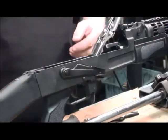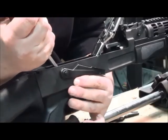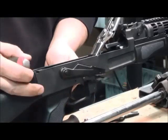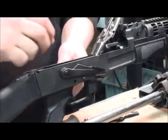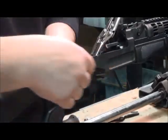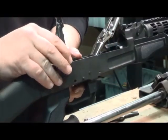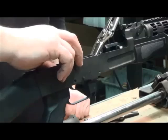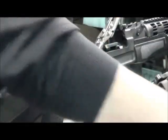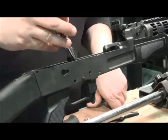Go inside and relieve the shepherd's hook on the trigger pin, then slide it right out. Move the trigger forward and take the safety out — rotate it vertically and slide it out. With that done, take the shepherd's hook right out. The trigger will slide right out. Then push the hammer pin out, which allows you to slide the hammer straight to the back and up.